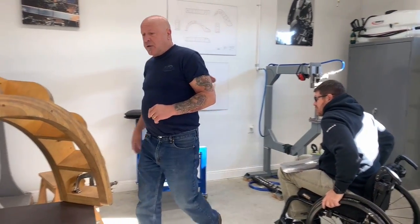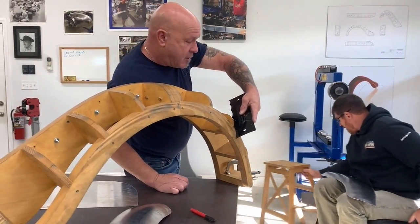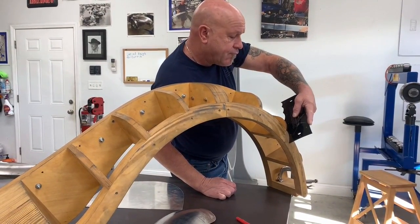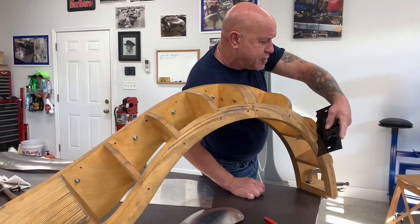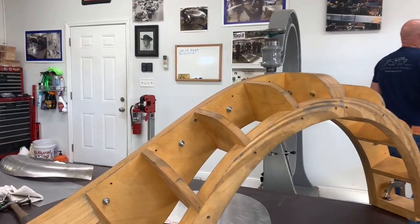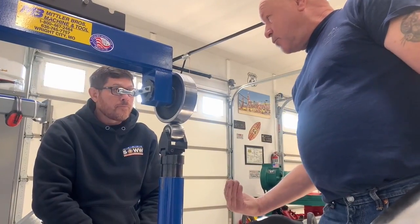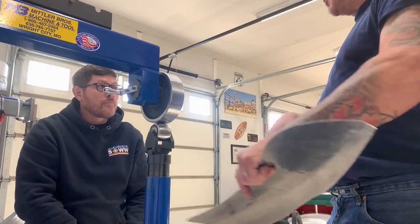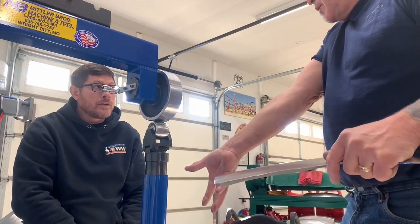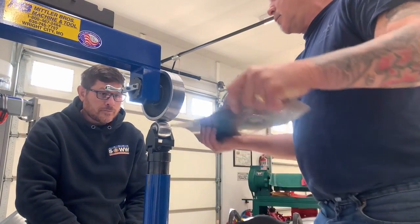We'll get the gauge. I'm thinking that you're going to be looking at a number four radius on the buck, as you can see there. So I would suggest using a number three radius for the wheel. And being as this is a bottom feed and that's a top feed, the direction is the opposite. So as you turn this one this way around, it's getting looser. You just turned it this way, it's slightly looser.